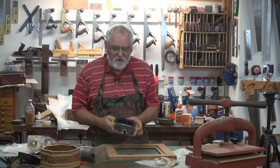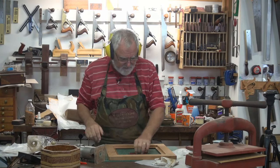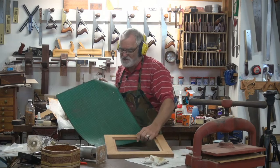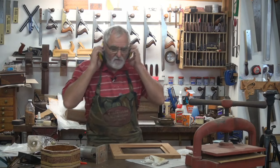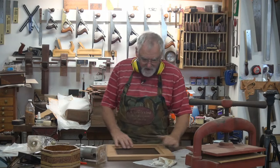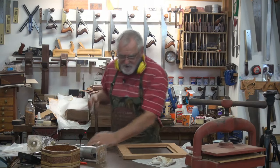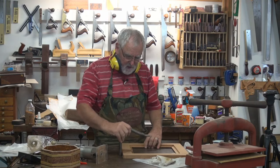No, don't use boiled linseed oil in marquetry, mate. Because it dries, and when you get a finish, you won't get the same finish. So, no, raw linseed oil, or the other one I've used to great effect, which is the French way of doing it, is with paraffin oil, which is a lot thicker.